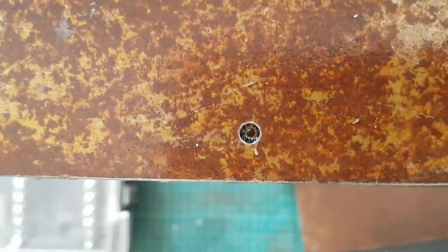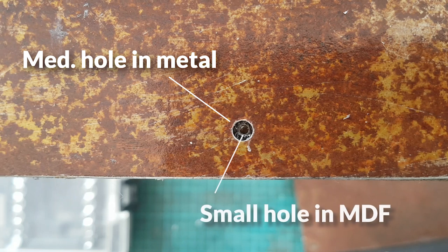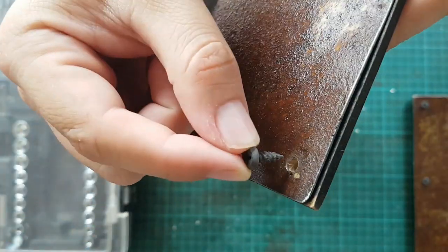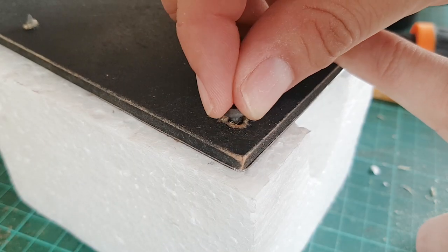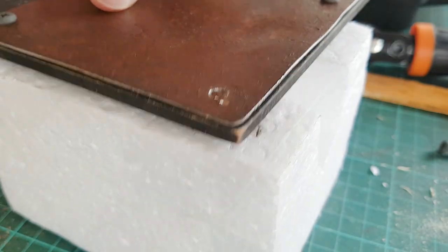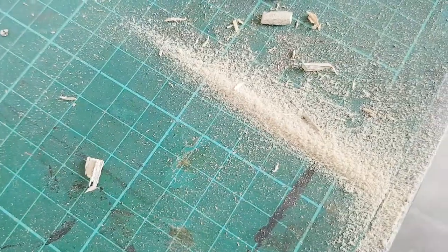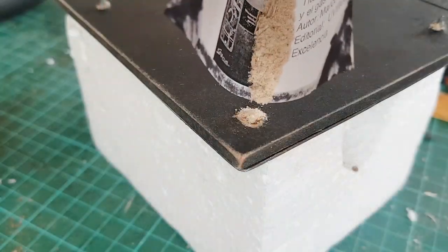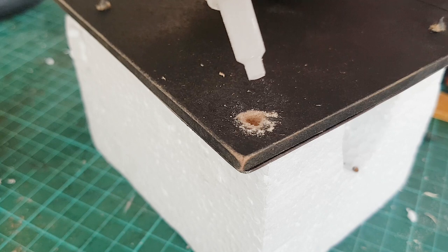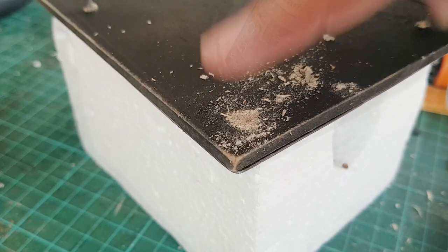This was the first significant mistake in the project. I was supposed to make a medium hole in the metal part so the screw could pass through without any problem, and then a smaller hole in the wood so the screws would actually grab onto that, but sadly in the last one I went all the way through with the big drill, so the screw became more or less useless. Here's a very helpful tip for how to undrill your wood: first cover one side with tape, grab some of the sawdust you probably have around from the previous drilling, and then start filling up the hole along with some super glue. Repeat this a couple of times until the hole is all filled. Since it dries very fast you should be ready to drill again in no time.